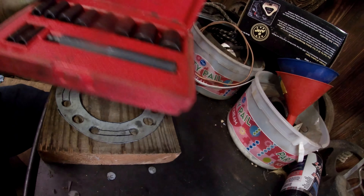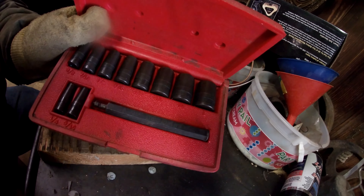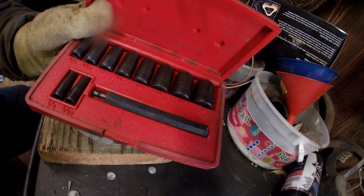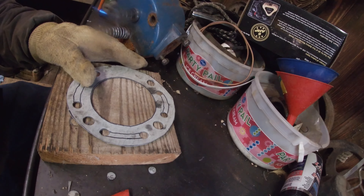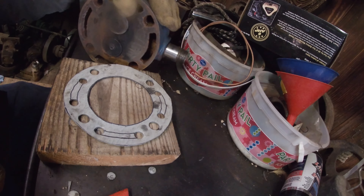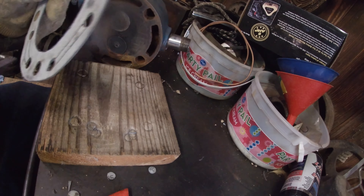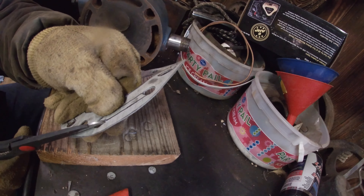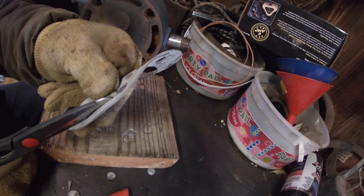We'll put our tools away. The punch set has all these different size dies with a driver part that has an O-ring on the end and clips right into them — makes it pretty handy. Now we need to cut the piece between the two holes to form our water jacket area. This doesn't have to be perfectly precise for these old engines — they work off of convection. The water doesn't circulate; it just sits in the hopper. As long as water can pass through and get to the head, that's all you're after. I think I might even be able to use my scissors for this, which is simpler than the utility knife for controlling it.